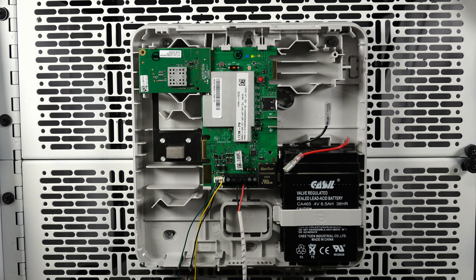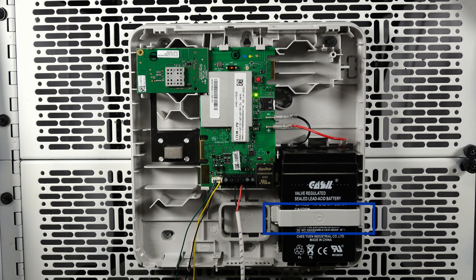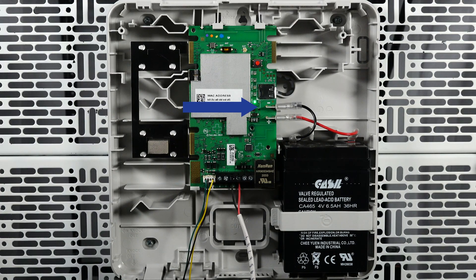Lastly, we can connect the battery. Please use the battery clip to ensure the battery doesn't fall out of the housing while the cover is open. Connect the black battery cable between the black battery terminal and the negative connector on the communicator. Connect the red battery cable between the red battery terminal and the positive connector on the communicator. Please reference the alarm panel's installation manual or summary of connections to determine where to connect the ECP wires on the alarm panel.